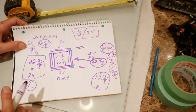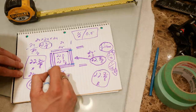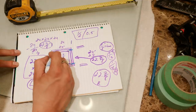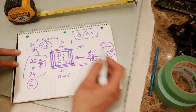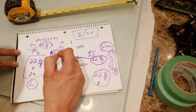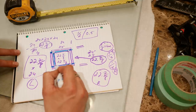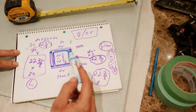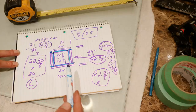The next thing to show is where the silicone is going to go. Silicone goes up and down vertically along all the inside corners. We also need silicone along the entire bottom perimeter — so silicone goes here, here, here, and all around the bottom. Silicone goes all around the bottom perimeter and on each inside corner.